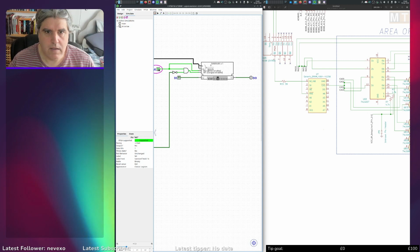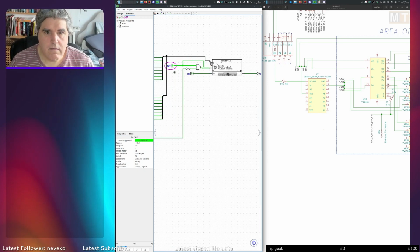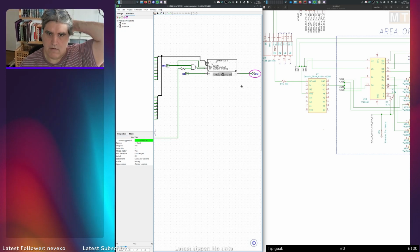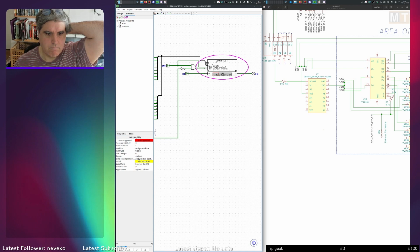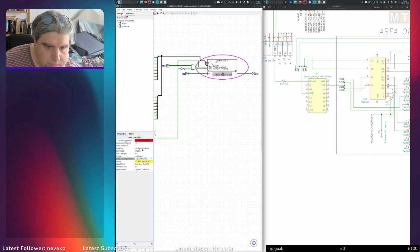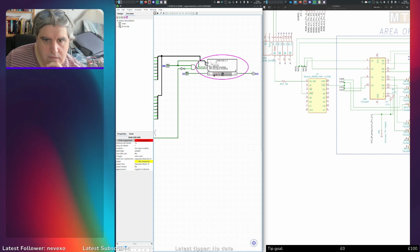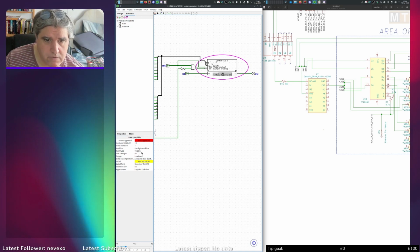Why is that not giving me anything on? That must be on and that is on. As soon as I do that, output enable, that should go high impedance. But why isn't it? Separate data bus. Anybody ever used VRAM in Logisim before? Why doesn't that go high impedance? I mean, I can add my own buffer to it to fix that, but it should go high impedance, I'd have thought, since it's got an output enable.